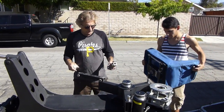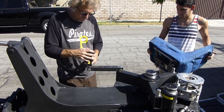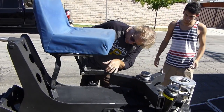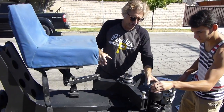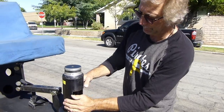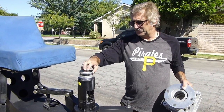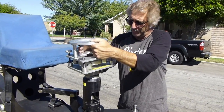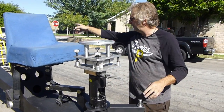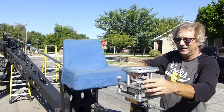The crane is built for 24 feet. Next part is putting the seat on. I like to put the longest extension on first, horizontally, and then put on the smaller section vertically, and then the seat goes right up on top there. That's usually a pretty good height and distance for the operator. After that, you put your thermos on, and I always make sure that this control is out away from the operator so there's no chance of him hitting it with his leg or knee. I usually prefer to go with the shorter thermos first, unless they really need the height. Then the head goes on right after that, making sure that this thing is away from the operator. Everything is front-heavy now — it's on the ladder. Next part is going to the back and adding weights to balance it out.